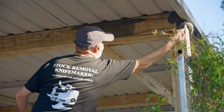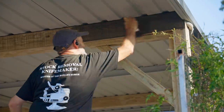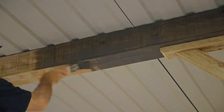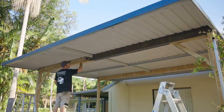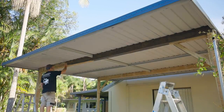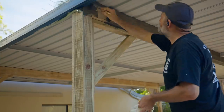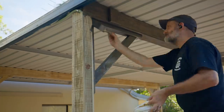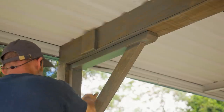I bought the weather grey finish but thought that the color was too light so I darkened it with some black. We weren't sure whether to paint the wood to match the posts on the house or to stain them. We compromised and decided rather than stain it a natural wood color, we'd stain it with a similar color to the house posts, and both Kath and I are very happy with it. I let it dry for an hour or so before recoating, but with this product you can actually go straight back over it.